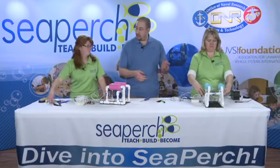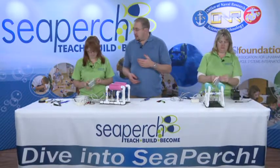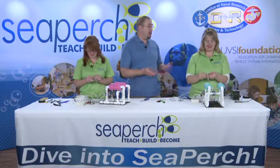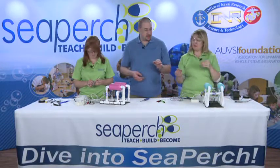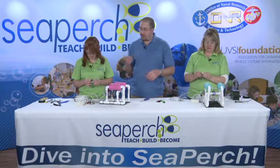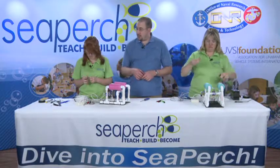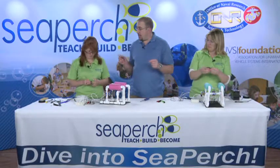So what we're going to do now is grab the butyl rubber — otherwise known as monkey dung, which is a plumber's term we did not make up. You use about a nickel-sized piece of that. You can just rip it with your fingers, or cut it if you want to be real dainty. You're taking a little teeny piece and then stringing it out.